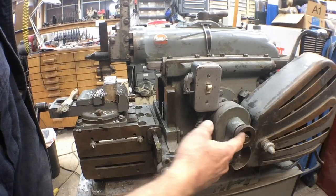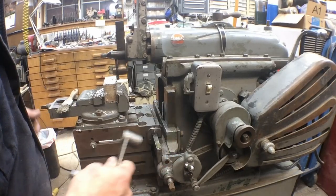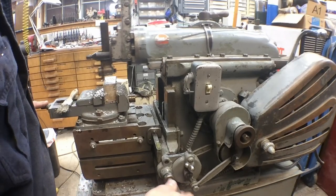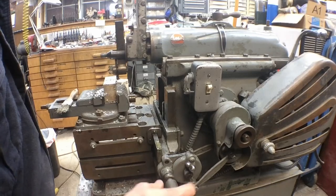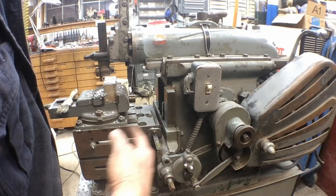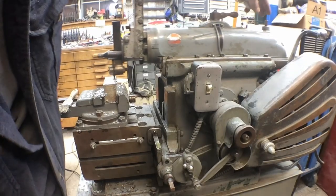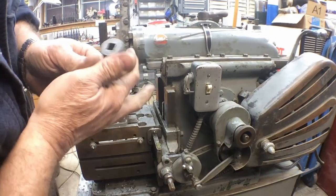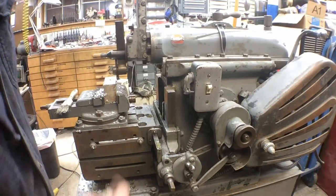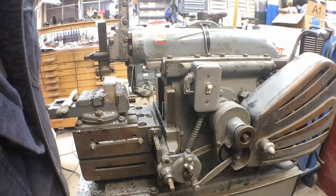This adjusts your stroke length. Atlas did a really good job because all the adjustments on this machine are operated by one wrench — a square wrench. It runs the vise, it's the size for the vise, it's the square for the traverse of the table and the elevation of the table. You loosen this nut and that adjusts your stroke length — it's a 7-inch shaper so you've got 7 inches of stroke. This one up here adjusts the positioning of the ram, front to rear for how far it traverses from the back. You loosen this and adjust your traverse there.